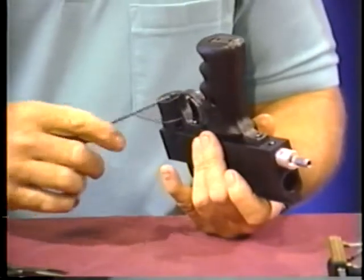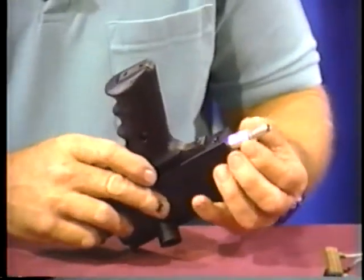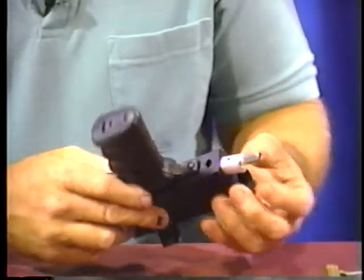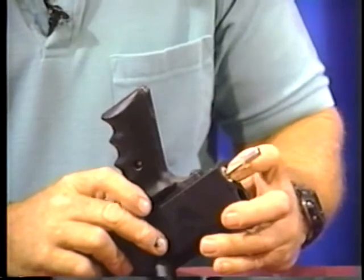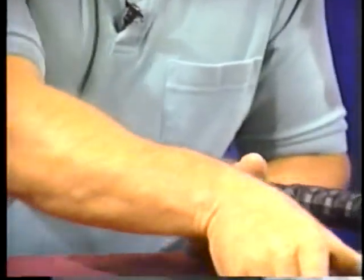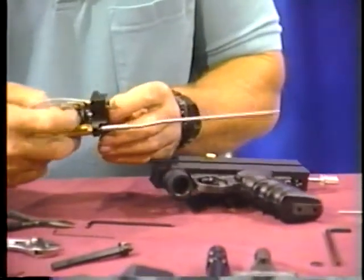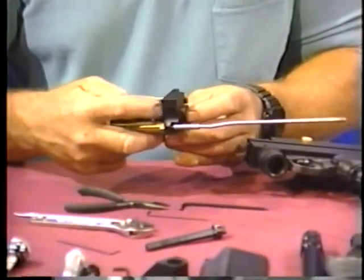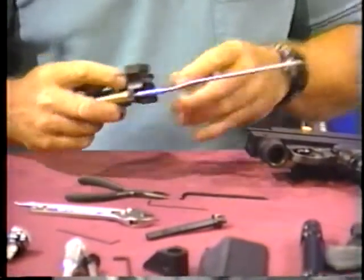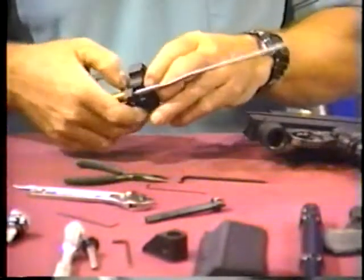Right. And one of the reasons we put a short screw in the back, if you don't, it's going to hit your velocity adjuster. Now it's time, we're going to put the cocking system back on at this point. The cocking system has what they call a banjo bolt. It's got a hole in it and a side hole in it, and that's where your CO2 comes from your air receiver through this and into your cocking mechanism.